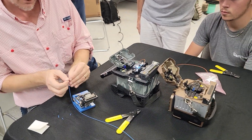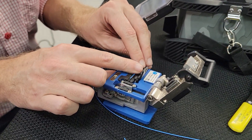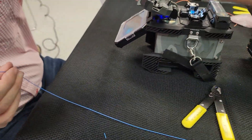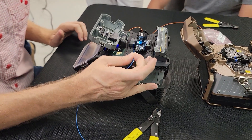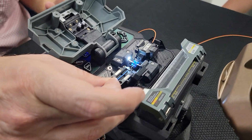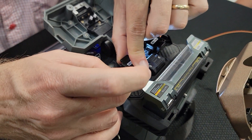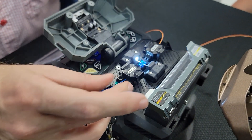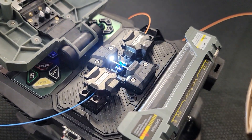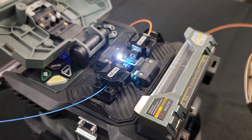Now I'll bring my cleaver to this side — 15 again. Same deal: prop with my finger, roll my elbow up a little bit until it's all flat, then close it down. What I want you to do is peek in here and see the fiber halfway between the V-groove and the electrode. That's what you want. The machine will do the rest — if you can get the end of those fibers in like that, the machine will do the rest.